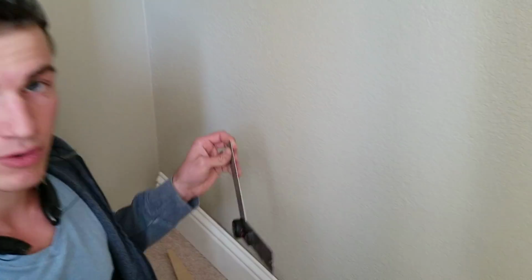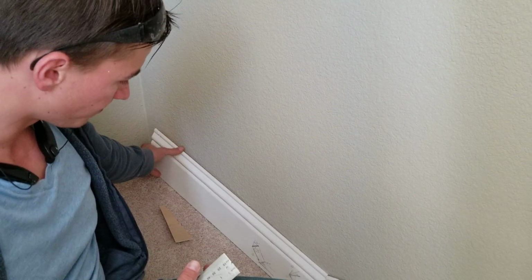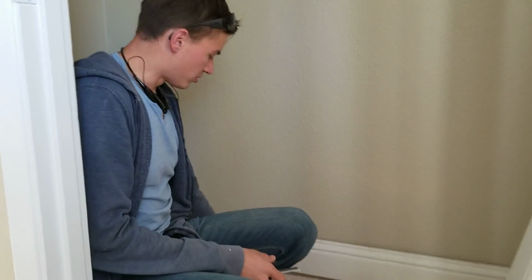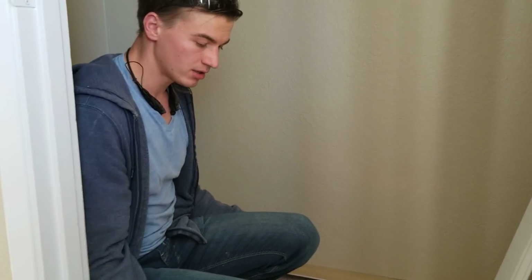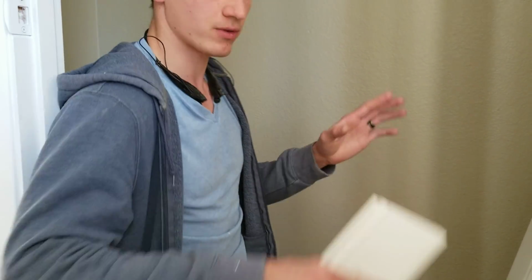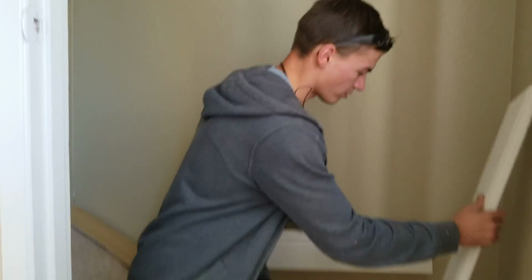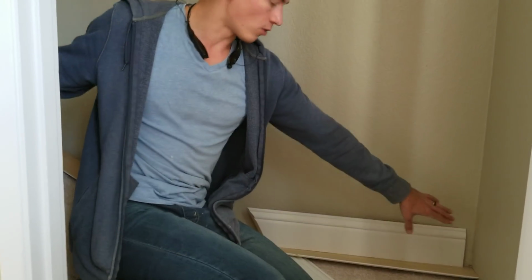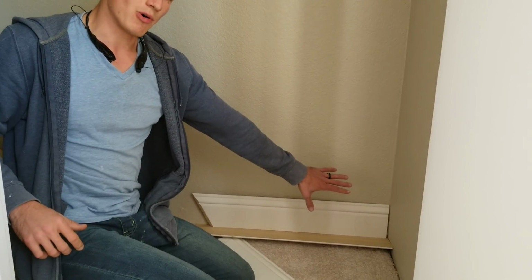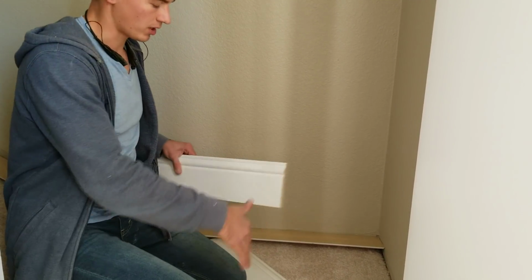Perfect. Now you're thinking, okay, this one is 120 degrees. We measured that one. So what you're going to do is you're going to think, hey, there I don't need to make a double joint. I can just take the 90 degrees that I have. So, okay, let me backtrack just a little bit so you know what I'm talking about. If I'm going against a regular wall, so right here, if you can film it. If I'm going against a regular 90-degree wall, this is a regular 0 cut.